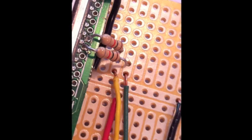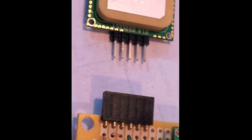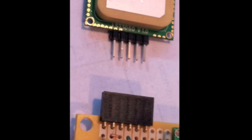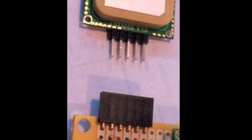There are only four connections to make to connect to the GPS, and two of them are shown here. I'm picking up the other end of the 10K resistors for transmit and receive signals to the WiFly. The GPS has five pins on a six-pin header. The GPS pins are ground, ground, transmit, receive, and VCC — so I'm basically offset into the six-pin connector. You need to consult your particular GPS's documentation. This is the little LS20031. Rather than try to cut off the six-pin header, I just decided to offset it. In my particular installation, the left three pins on the right-angle header are all ground, and then it's transmit, receive, and VCC.